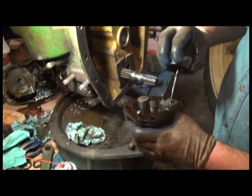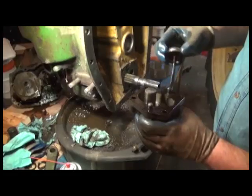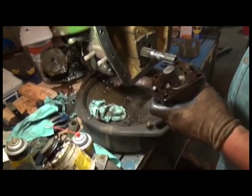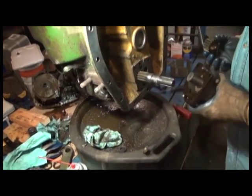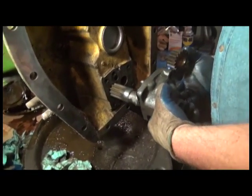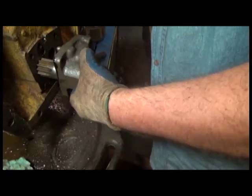You can get some in aerosol cans or whatnot, but whatever you do, don't use silicone on machine surfaces, and don't use a die grinder or anything abrasive here either. If you do have to remove any old residue, try solvent. If that doesn't work, maybe some very fine double-aught steel wool.